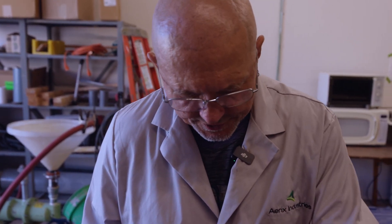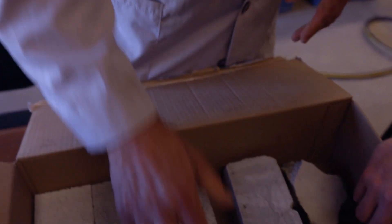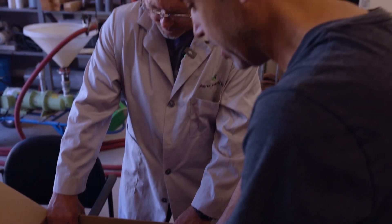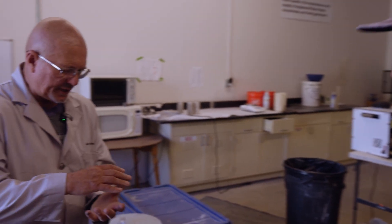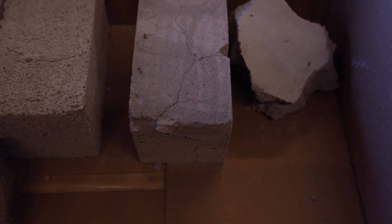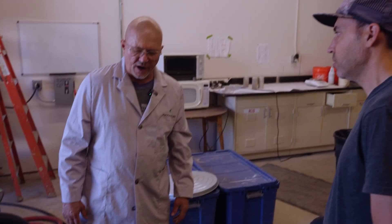The cracking is caused by the material not distributing compressive strength and heat uniformly during drying, causing it to crack. One contributing factor was that the samples were made in Arkansas in very hot conditions — mid-90s temperature-wise. The scientist explains you don't want your water above about 85°F. When the aircrete is in its plastic state and it's hot, gas rises and weakens it, which can cause cracking. On really hot days, they'll throw ice into the mix to help with this.